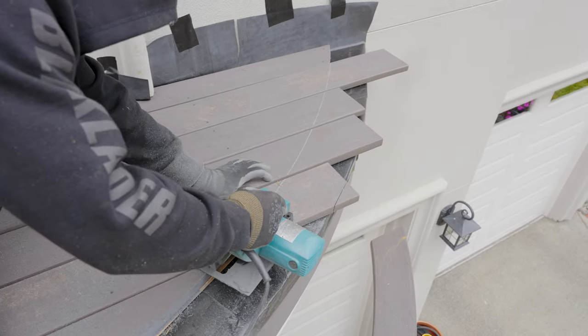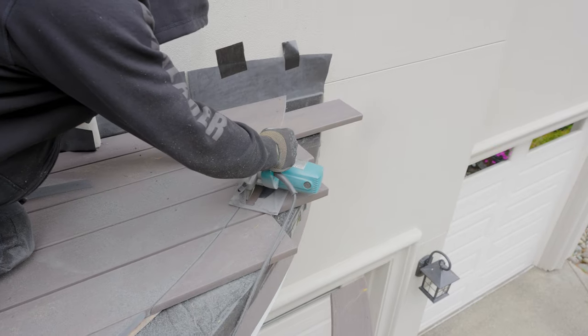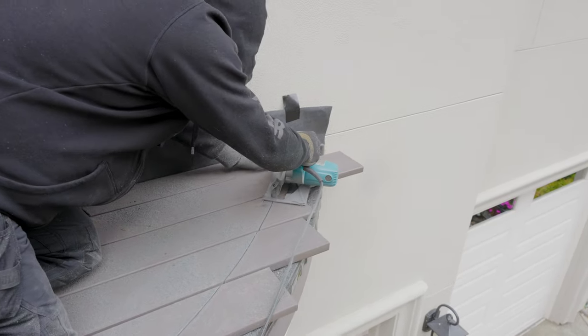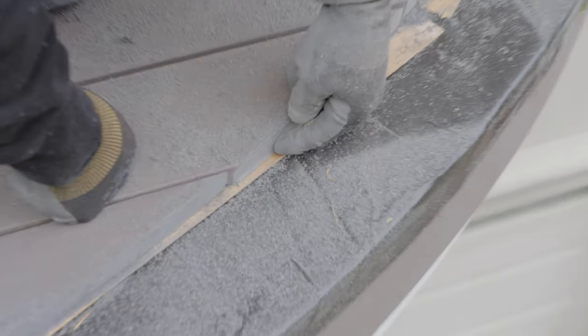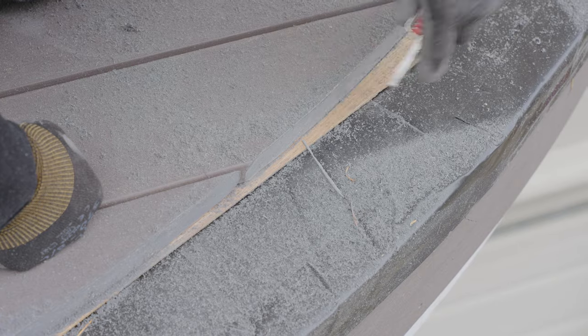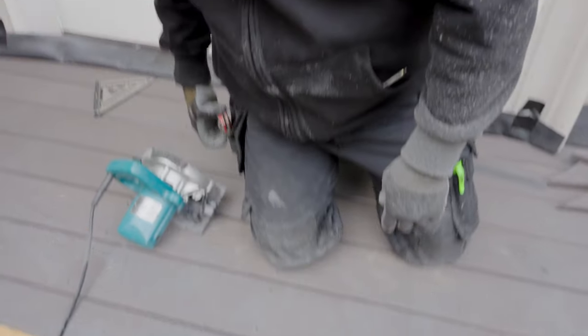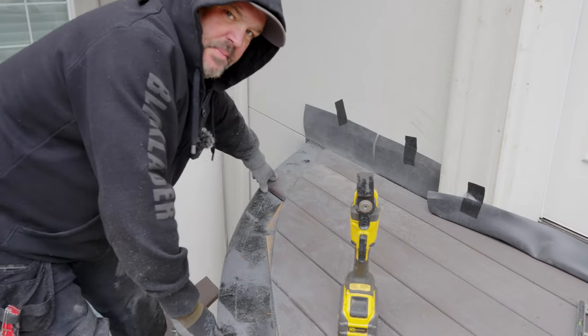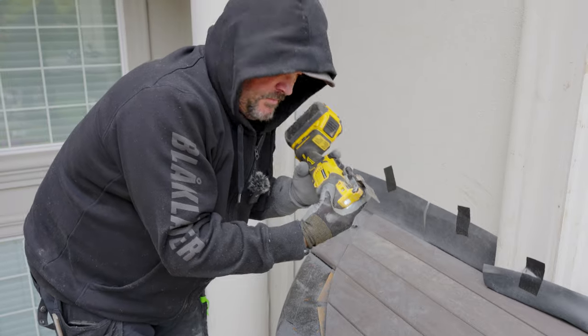I felt that kind of pin — I don't think this one's going to get fully cut, but we'll see. Well, okay, it cut through. There's a tiny little bit of fray left, but those are easy. You can take a construction knife and just slice it because you know you're safe — you're not going to cut through the bladder because you're on the protective piece. I think I have one over here that did not cut through, and I'm going to probably have to use an oscillator. I have protection under here, so I'll go ahead and use the oscillator to cut this out.